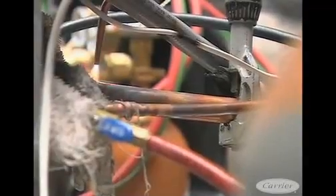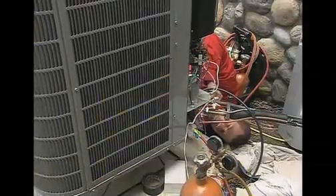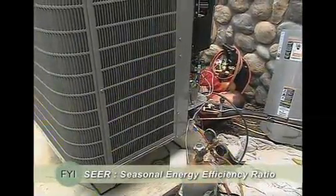And of course, efficiency is what gives you your energy savings. With this unit, we've got efficiency ratings as high as 13 HSPF, which is a significant leap over what the industry has had before. But the interesting thing too is that the same unit can get you up to 20.5 SEER for cooling — a very high cooling efficiency along with that heating efficiency, which is really significant.